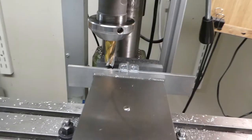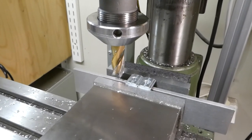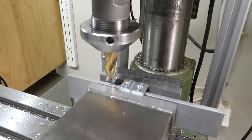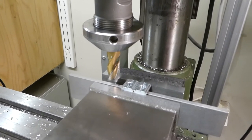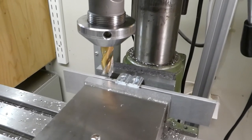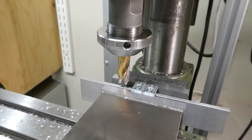I have decided to put the nuts up in the vise in the milling machine to take off that half a millimeter, 0.7 something. Let's see. I just put two of them on a parallel. I will see if I can take more, but these are the two that have a lock spring that keeps them in place. The other ones that I use should be sliding easily, so I take off that locking thing. So let's see if this works, if it stays in the vise or if they just escape.